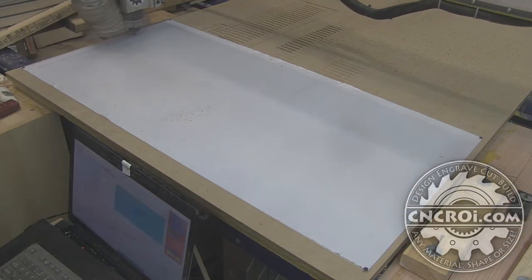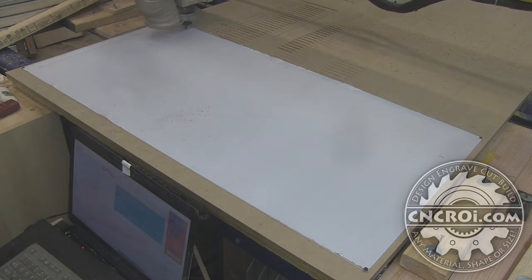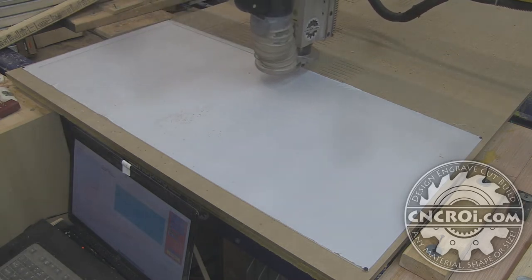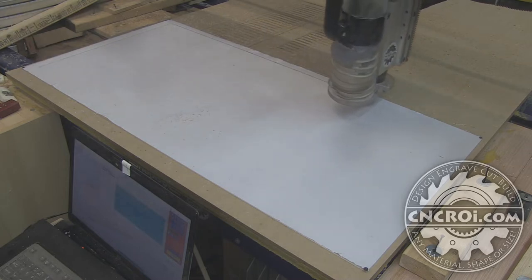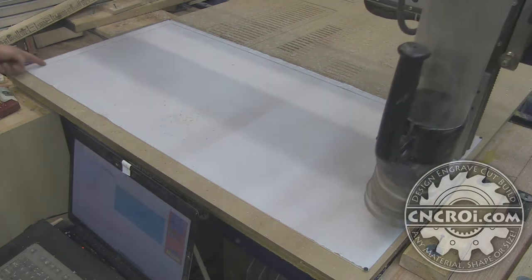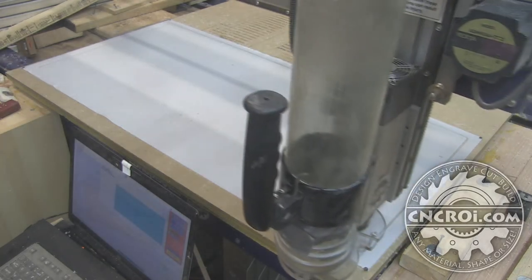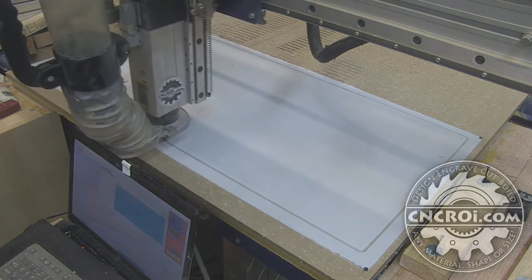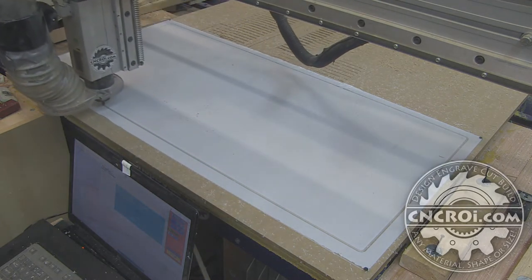It's amazing the diversity of projects that we've done here in the shop using polycarbonate. In this case, the polycarbonate is roughly an eighth inch thick, or three millimeters, and it cuts really well with the router. You just have to make sure you have a really sharp bit — if the bit is not sharp, you end up getting a lot of chattering along all the edges, especially if you're using an angled bit. It just skips all over the place.